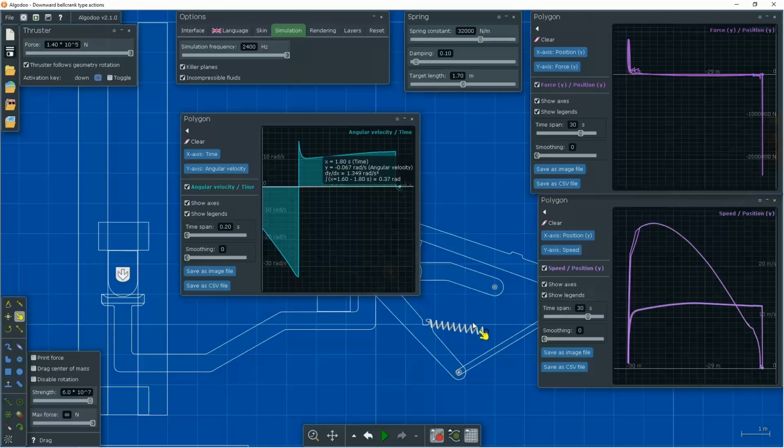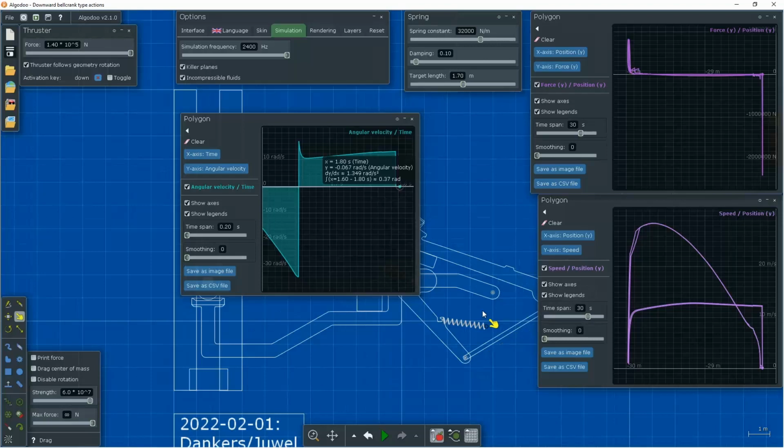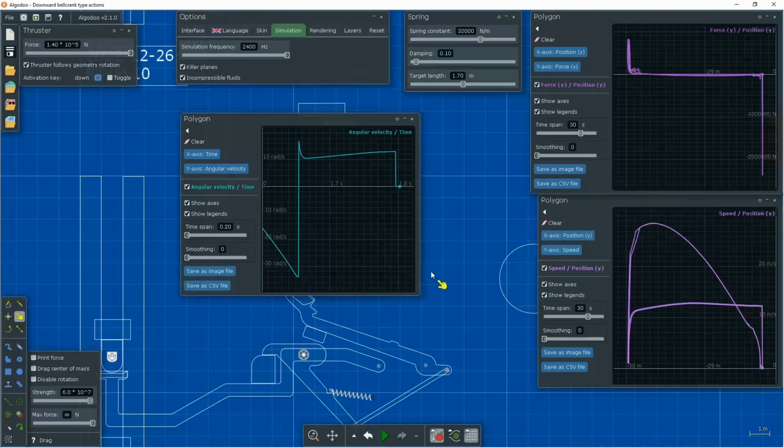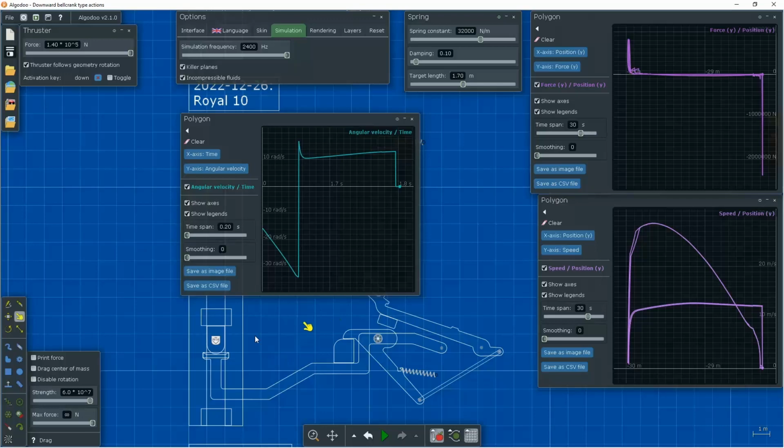But again, generally, even in person, when you're adjusting these typewriters or designing them, if you install heavier springs, or if you set it to a higher touch control where the springs start off more stretched, then though your type bars will return faster, your touch will also be heavier, making it harder to press them, and also more difficult for you to release the keys more quickly. So basically there's a whole balance between whether or not to make these springs heavy or light in order to maximize your typing speed.